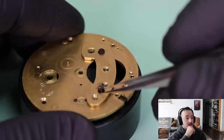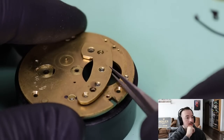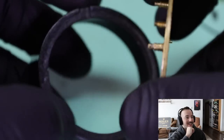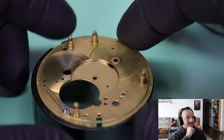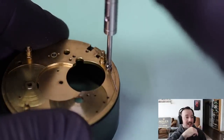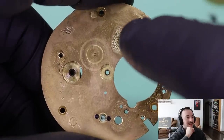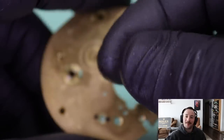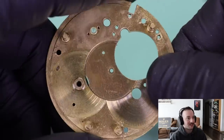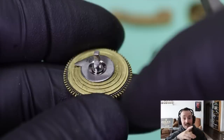It's actually a removable bridge. Look at all the grease — oh my goodness. Just removing the last components. That is the spring to the fusee click. Look at that — yes, it needs to be cleaned and oiled. That oil has seized; it is thick and useless now.